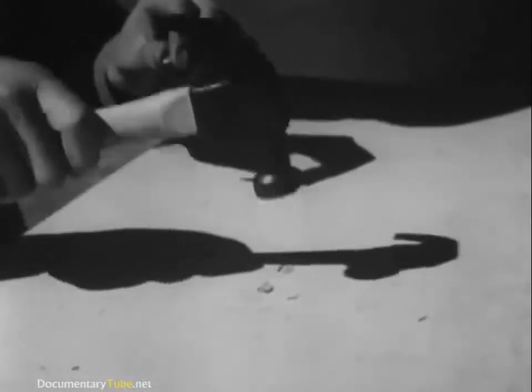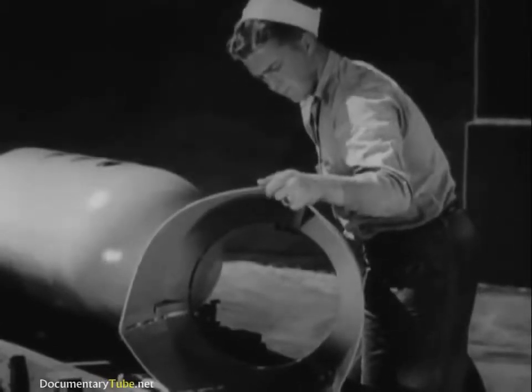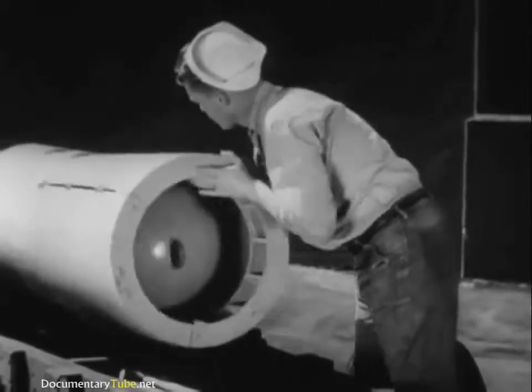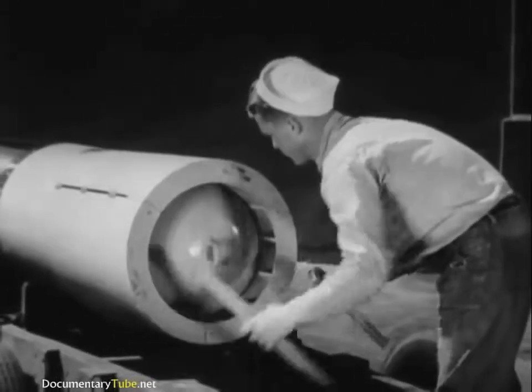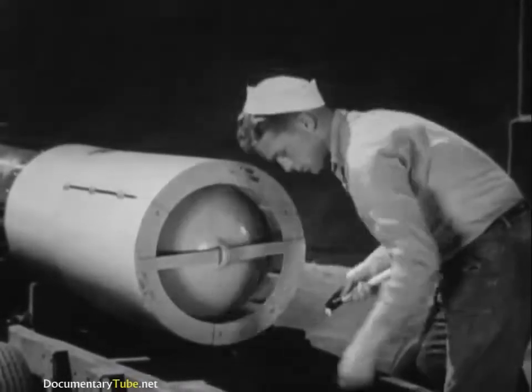The stabilizer is secured to the ring tail with wooden dowels which shear on contact with the water. The drag ring has two primary functions: to aid in air stabilization and to decrease the impact shock about 40% on hitting the water. This is especially useful in cases of extremely high altitude drops. In a torpedo drop, any deviation from true air trajectory is liable to cause damage on impact. The drag ring helps to eliminate pitch and yaw. Like the stabilizer, this disintegrates when it hits the water.